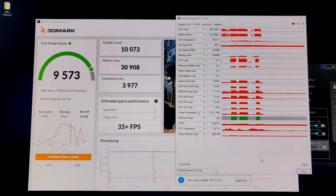I have a feeling that these readings, while they look a bit weird, might actually just be erroneous - especially if you look at something like this. MVDDQ, which should be the memory power rail, is apparently drawing 100 watts, while the actual GPU chip is only drawing 70. That is a bit weird - your memory chips should never be drawing 100 watts of power. And giving them a light touch, yeah, they are not as hot as they would be if they were drawing 100 watts. Because there are 12 memory chips, that would mean almost 10 watts per memory chip, and trust me, you could feel 10 watts per memory chip.